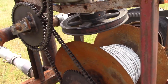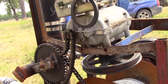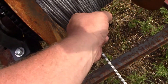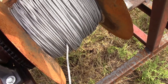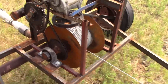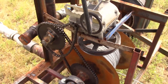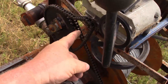Biggest surprise to me though — when it pulled this down it had popped the belt. I put the belt back on. It was a hot day and I went 'oh no' — then it pulled this cable right down in there. That's gonna be a real pain to get back out. But now I know I'm going to need more than just a disconnect to stop the power from transferring there. I'm going to have to use a slip clutch, probably up here right on that pulley.